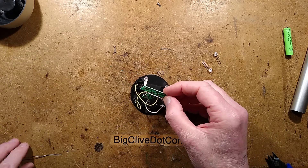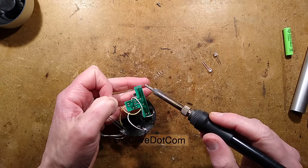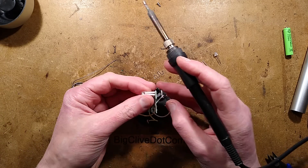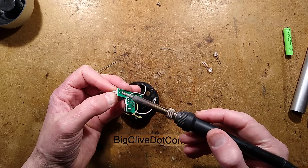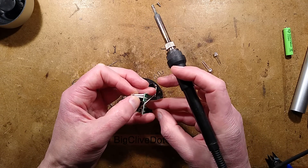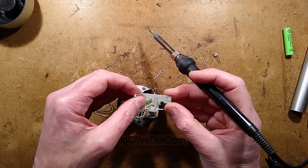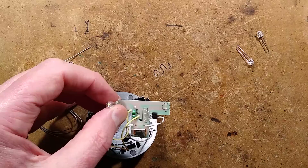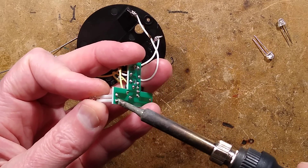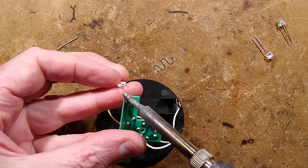The first thing I'm going to do is flow some fresh solder onto these existing LEDs. I could reconfigure them to wire in series — a previous experiment showed you can run several LEDs in series with these chips. I'm going to heat both solder connections at once and pull that LED out. It's not wanting to come out — it's trapped for some reason. There it is. Is this marked with polarity? Yes, it's got the flat there. Now I'll grip the circuit board and flow these two solder joints. They're out.